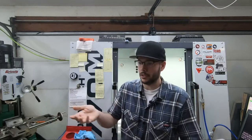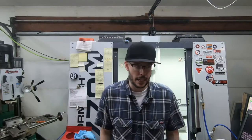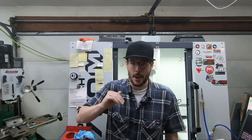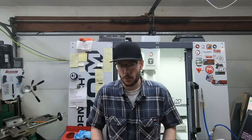By eliminating those manual input steps with the tool changer and fourth axis on the new 1100MX, it should more than double our output. The machine will be doing all the setups and fourth axis work while this machine is just cutting parts the whole time. Even small things like a six-minute toolpath where you don't catch it for another five minutes because you're working on something else — all those little gaps add up. I'm really excited to get the new 1100MX in here.